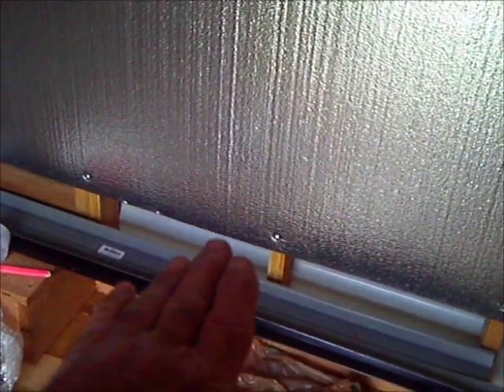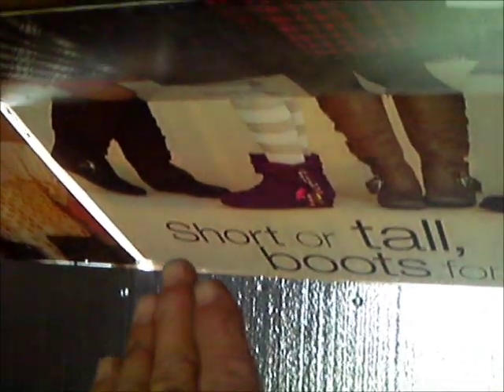You can see where the fan is. Just on the right side of the fan there will be a plastic sheet hanging down, and that plastic sheet will have a 2x2 or something rolled up in it. It will be set on top of the stack, forcing the air that comes down from the fan to go into the stack where all the stickers are. Stickers hold the wood apart. The air will go through the logs and then it's forced back down to the floor, where it will go up the wall to the drafting board that brings it up to the ceiling, and there's clear plexiglass there that the sun is coming down onto, heating the cardboard and creating heat.